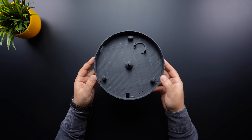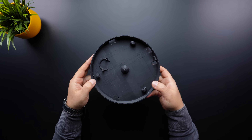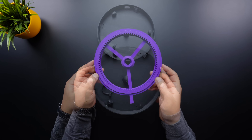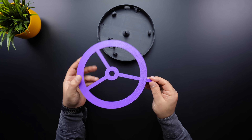This project consists of three main 3D printed parts. The first part is the base, which includes three bearing slots, a stepper motor mount, three mounting leg slots on the sides, and a slot for a power switch. The second part is the gear plate. It has a bearing slot in the center and is the only moving part responsible for rotation.